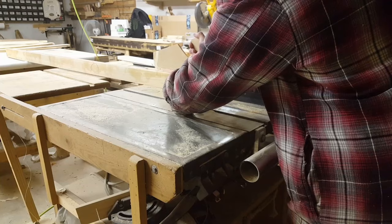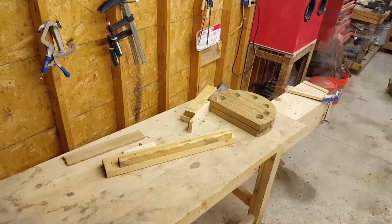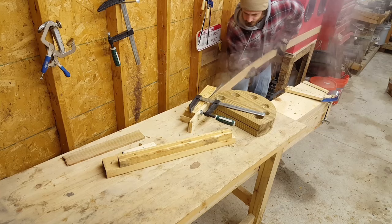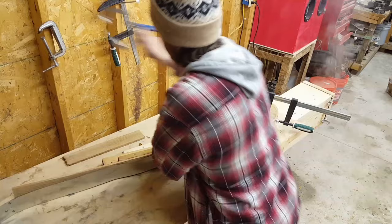Now it comes time to finally bend the wood. You have the right kind of wood, it's been milled and dried correctly, soaked and steamed for several hours, and now you only have about 30 seconds to complete your bend. Get everything ready before you start, put your gloves on, start your camera, then very quickly open the box, take out the wood, shut the door so the other pieces don't dry out, take the end of the board between two pieces of wood, put the steel band on, pull against the form of the bend, hold the band really tight, and place clamps everywhere. Hopefully if you did everything right, nothing broke.